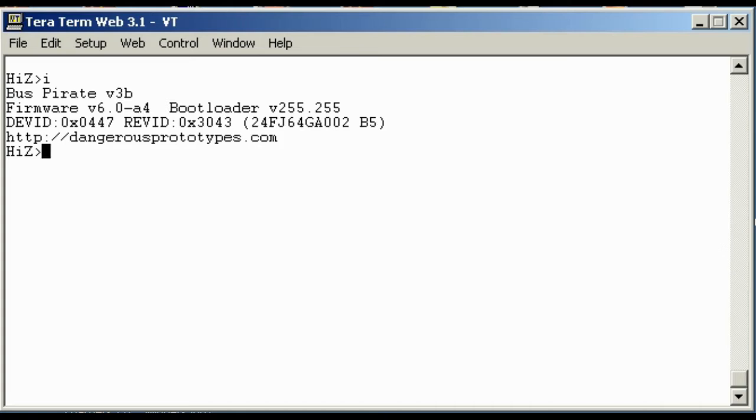I've got a hacked firmware on the Bus Pirate where the frequency command has been changed to measure the capacitor. You can download the firmware on the forum — we'll put a link below the video. Just use the F command in any mode and it will do the capacitor measurement routine. It discharged the capacitor, then charged it through the 100k resistor, and counted how long it took before it saw a high level on the other pin. In this case it took 145,000 ticks of the timer.